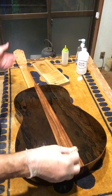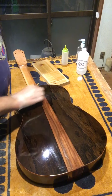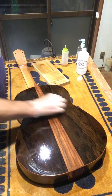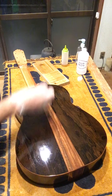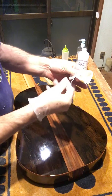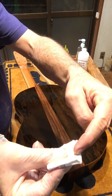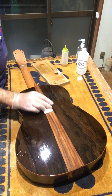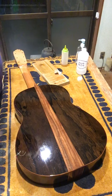People use different kinds of oils to lubricate it. Some people use walnut oil — I used to use walnut oil. But once the pores are all sealed with shellac, you can actually use mineral oil on top of it, because the mineral oil is not going to soak into the wood. The way that I begin the process is I take a piece of cloth, fold it into a square, dip the edge with shellac, and make it into like a squeegee. In the beginning stages, you can actually paint the shellac on just like that — using it as like a squeegee brush — and you can cover up the whole guitar like that.